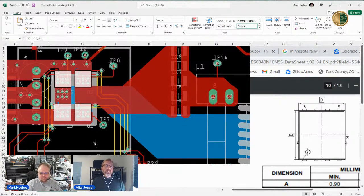Looking at the board, those four spots are so close together. Those squares are 0.2 by 0.24 inches, meaning they aren't more than about 0.24 inches apart on the large dimension and maybe a tenth of an inch or less from side to side. So you're not looking at 15 watts — you're looking at 60 watts of power in a very small area, probably three-quarters of an inch by a half inch.